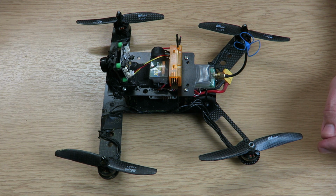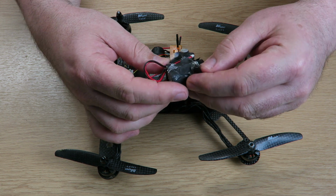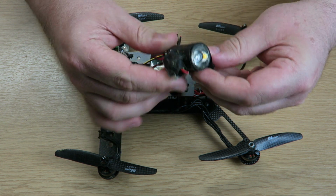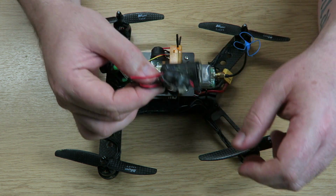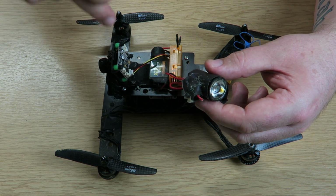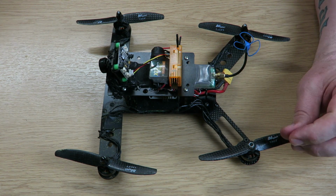flying. For those of you that were interested in finding out what the illumination I was using, I've been using this. It's looking a little bit beaten up now, where I've had it glued into various models. But this was what I was using. This is the Surveilzone 3-watt LED with the driver. It comes with a driver. You just wire that into your PDB, and away you go. I believe these are optimised for about 12 volts, but full description, full link in the description below if you're interested in those. They do work very well, but as some of you have said, it may actually work better without the light if you're using such a good camera. If we was using subpar cameras, then these are definitely the way to go.